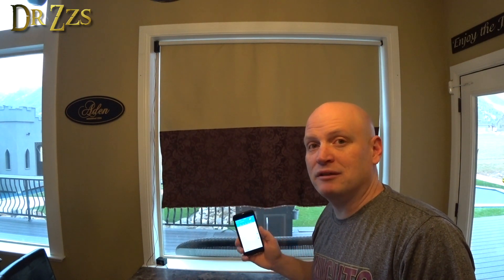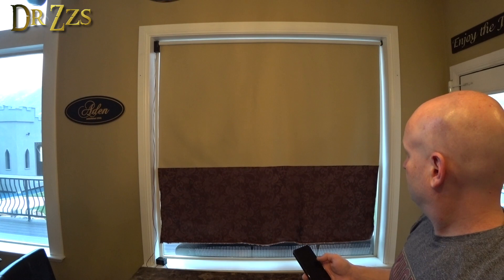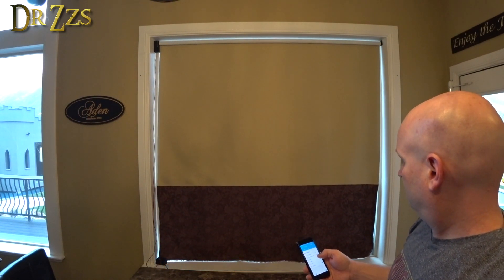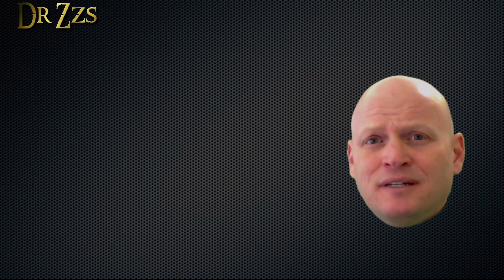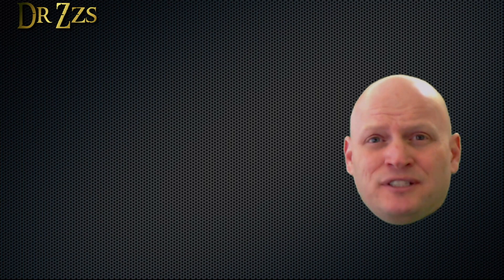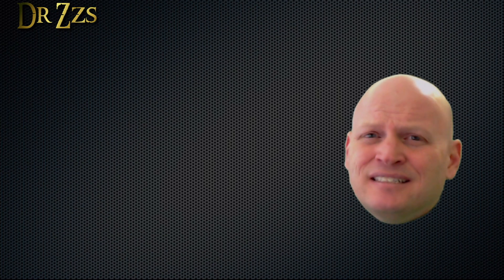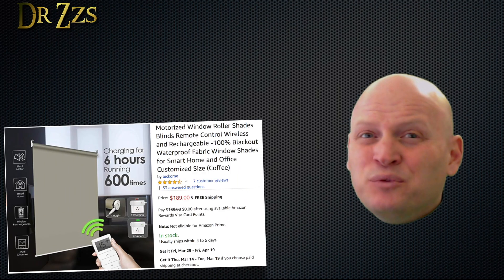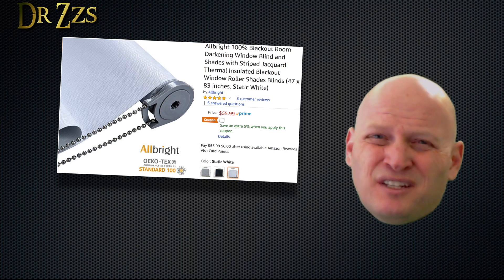But if I do that, then my full control up and full control down will be off. So I don't want to hit my full control button that does the 99 seconds up and 99 seconds down unless I'm exactly sure that I'm all the way down or all the way up. That actually turned out to be not as hard as I thought it was going to be — that's a nice surprise. I'm very happy with the motors, motor controller, ESPHome, and the integration into Home Assistant — those are all perfect. Building the shade myself and trying to get it lined up so it doesn't telescope — that needs a little work. That's probably a good reason to buy an already built shade and then just add the motorized and automated parts to it.